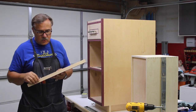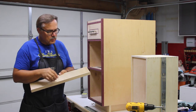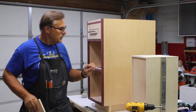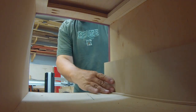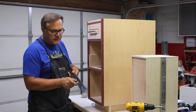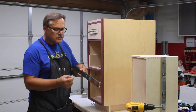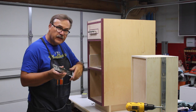I'm going to use the same jig, but this time the quarter-inch piece — which was resting on top when I put the slides on the drawer — will have its bottom resting on the cabinet bottom. That's going to raise everything up a quarter of an inch, giving the drawer a quarter-inch clearance at the bottom and a quarter inch at the top also. These slides have little tabs on them and I'm just going to bend them in a tiny bit, which allows you to screw this in, and as the drawer slides in, it will spread them apart and get a perfect fit.